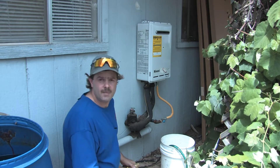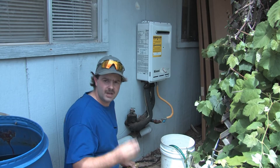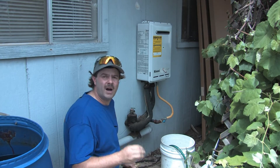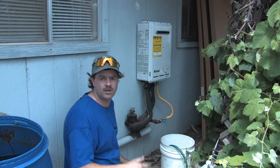Also, you'd want a certified technician to come in and check gas pressures and make sure it's burning clean — i.e., carbon monoxide — to keep it from being harmful. This one being outside, it's not so critical, but it really does help to maintain the gas burning of the system because it could end up with hot spots, and that can wear your heat exchanger out.